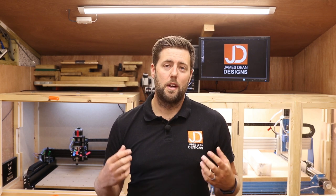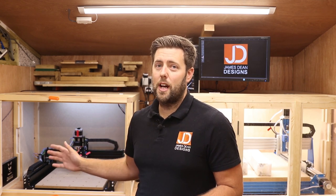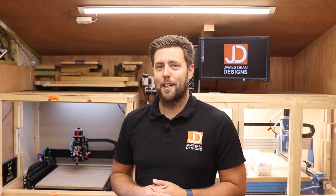When my Fox Alien machine arrived and I assembled it, all of the tensioners had been used to their maximum capacity. The tension was okay at the time but I didn't really think much of it. However, what I realized is that because all the capacity had been used, when they started to lose tension I'd have no way to adjust them. So what we're going to do is take the belts off completely, reinstall them fresh, and set the correct tension. Let's move over to the machine now.